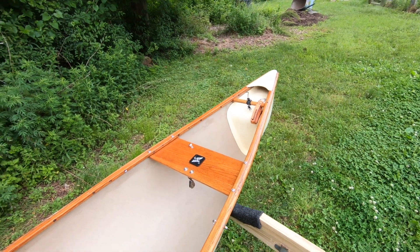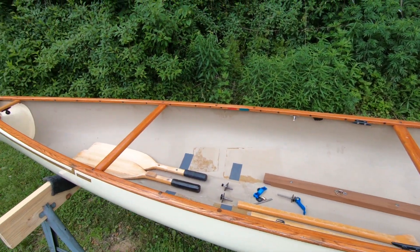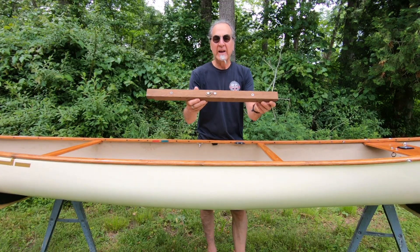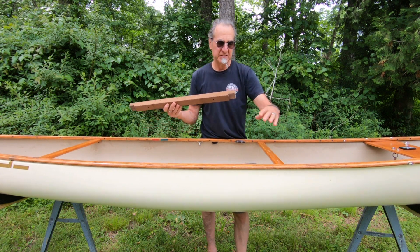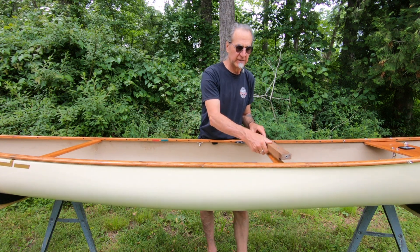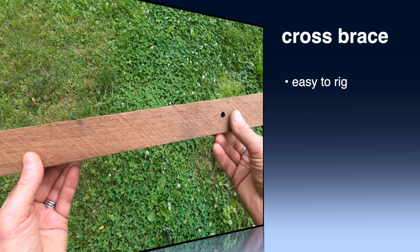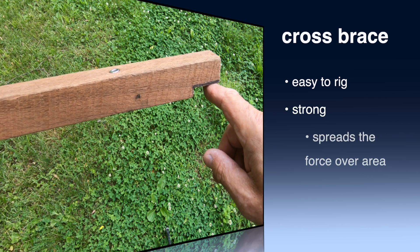Okay, let's build this thing. I want the leeboards about one-third of the way down from the bow, which puts it right about where this thwart was. What I have is this nice piece of walnut that I cut, with little recesses in here. As it sets on the thwart, the shoulders of it will set right over the gunwale. This hole matches what's in the thwart — it sets right in, and this part here will set on the gunwale.